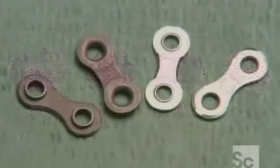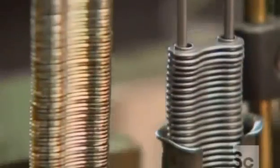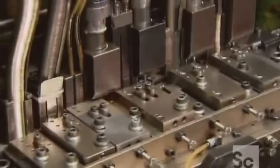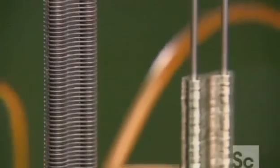They're now ready to assemble the chain, one section at a time. Tubes feed the parts one by one into the assembly machine. Gripper arms adjust their position to assemble the links to other chain components, such as retainer rings and spacers. The machinery presses pins into the links' holes to secure the assembly, then grippers move the completed section of chain down the line.